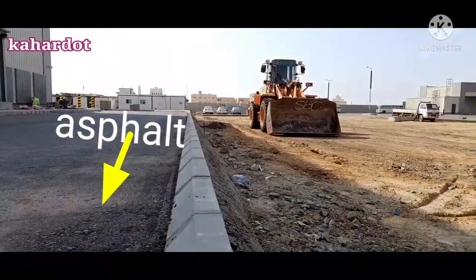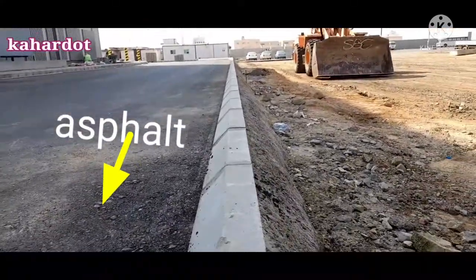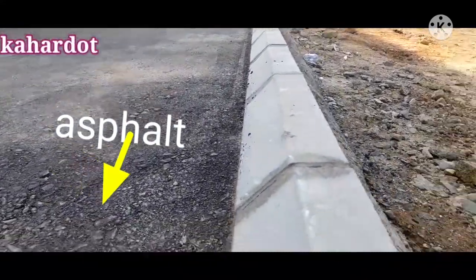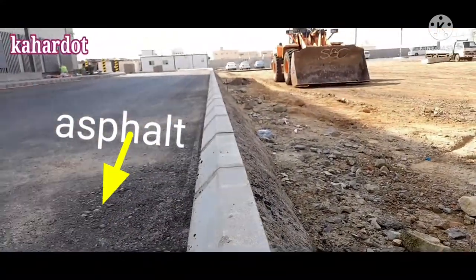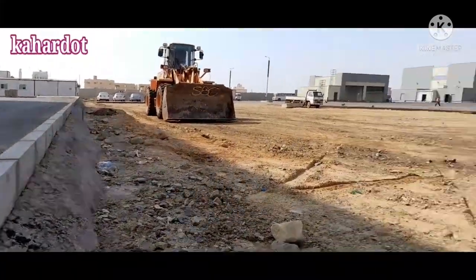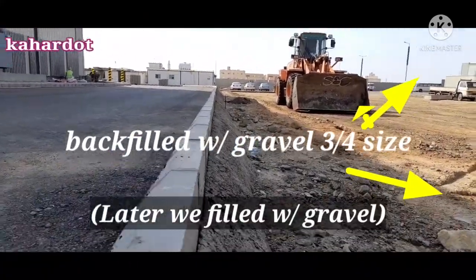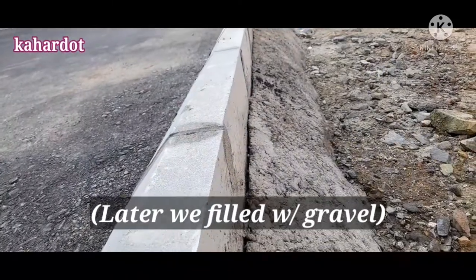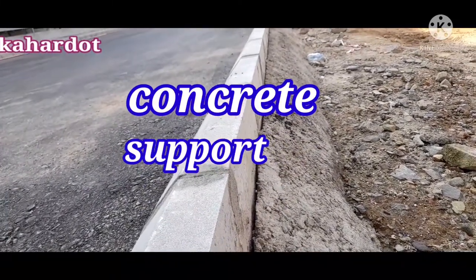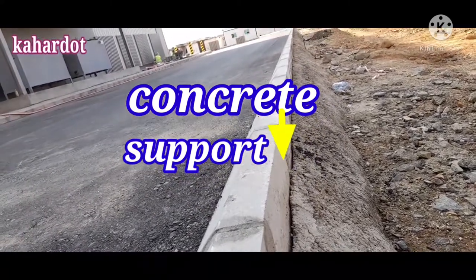You can see this location in our construction project. This part is asphalt finisher and the other side is other materials — that is why they required us to put concrete support as protection for vehicles passing this way. This curb stone needs good alignment, and this side is filled only with three-quarters inch gravel as required based on our construction drawing. When and where we use concrete support depends on the location.